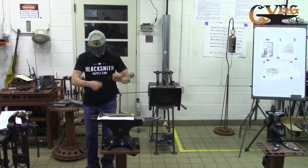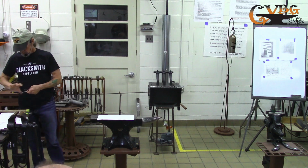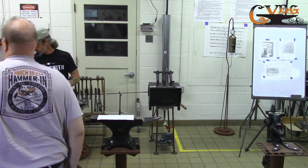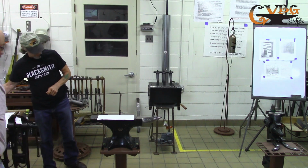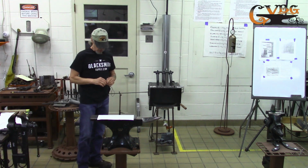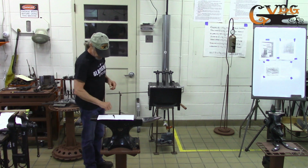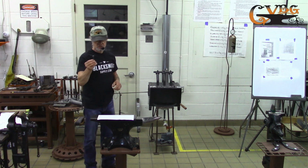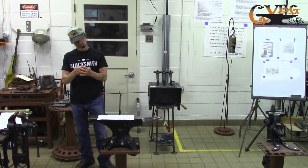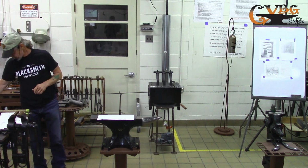Cut it off and then twist it off. And then put it in the header and put a head on it. One thing that's very easy to do when you make the heads, and I still keep making them sometimes, is I'll either not get it hot enough or I don't hammer it right, but you end up with a head that looks like that. And that's called a corner nail because you can put it in a corner. Not necessarily a compliment, making a corner nail.